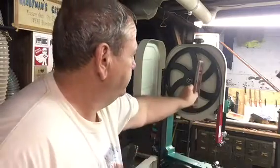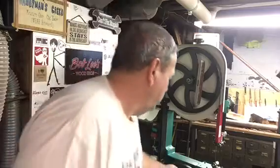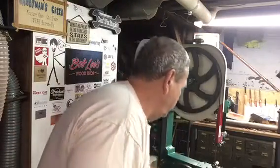And when I started today I just wanted to see if it would work. So I put the level on the wheel like he suggested, adjusted the wheel, and now the tracking is perfect, because all I did was level that top wheel and it holds the blade just perfect. I didn't have a whole lot of effort to do that except make sure the wheel was level to the saw, and it works like it should.